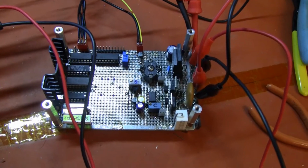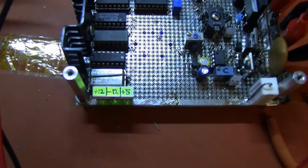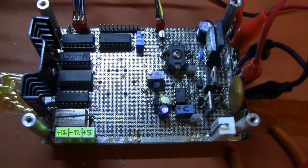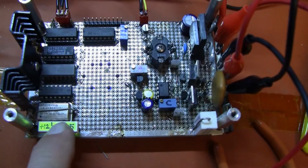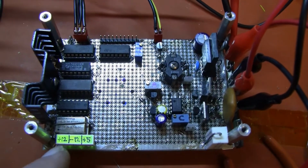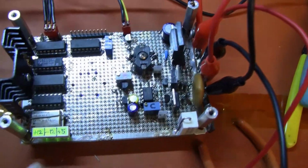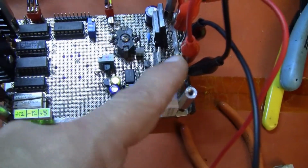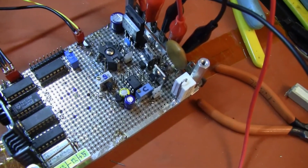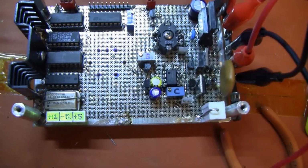So this is the entire board as it is right now. You'll note that I added some pilot lights to remind me that the power is on. Over here, once again in review, is the sync generator, some pulse shaping one-shots, the horizontal scan circuit on this half of the board, that way. All of this right here is the vertical scan that took up an entire 21-inch screen. It all fits there inside of perhaps 4 to 6 square inches.